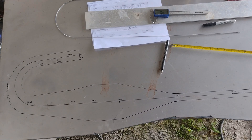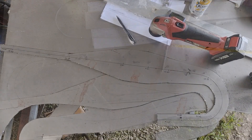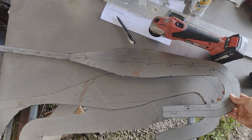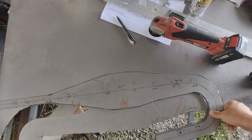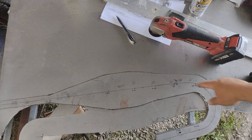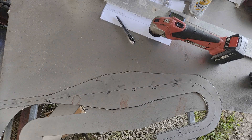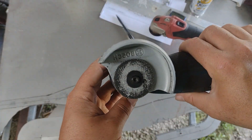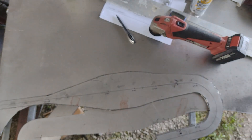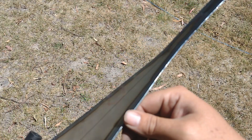We've got our two pipes cut out — the second one is slightly larger, which was the plan. I'll just clean these up, stack them together, and run them along the belt sander to get them all the same size, clean up all the oxides and rust on the sides. Both halves of the pipe consume an entire disc, which isn't too bad — they're only a couple of dollars each.